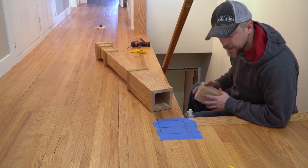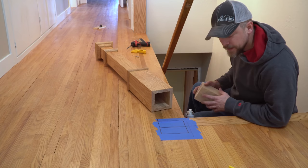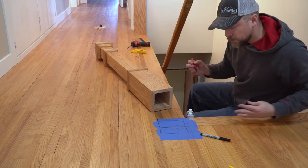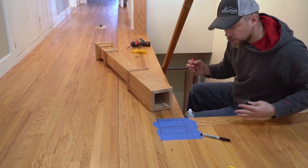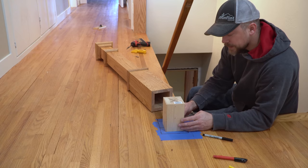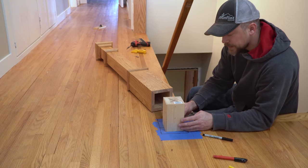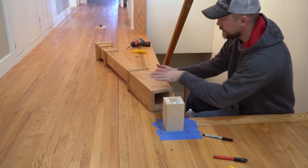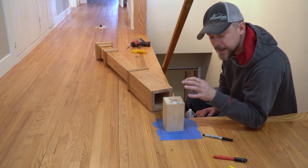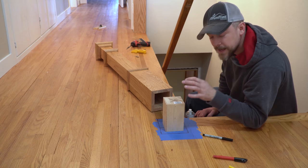I marked up where I wanted to go and spared you that because it was just a lot of putzing around. Right here along this center line there's actually a double floor joist that I ran into when I was putting the new hardwood down. So right here, running the whole width of this hallway, is a double floor joist and I want to get to that to help make this even stronger. Now the newel post is hollow at the base with this solid core. The idea is you get this set in place and run screws in from all directions to get it nice and strong, then slip the post back down over the top and run screws into it. I've got two growing boys that I think are going to use this thing as a boomerang to accelerate down the hallway, so I want it to be even stronger than that.